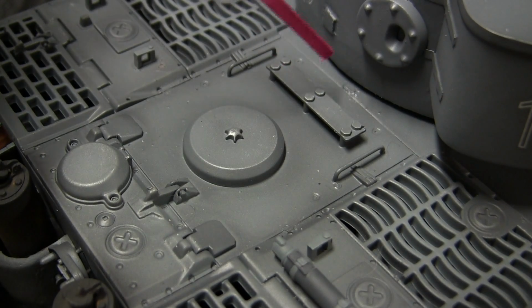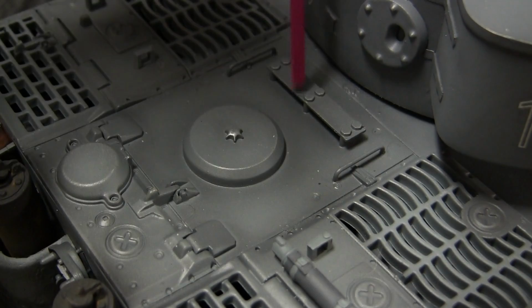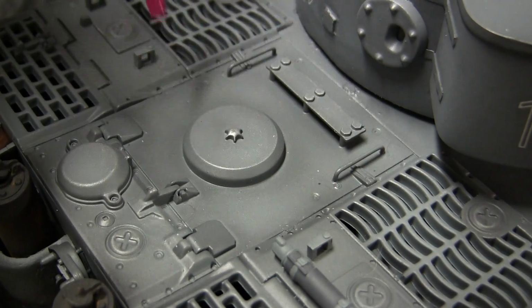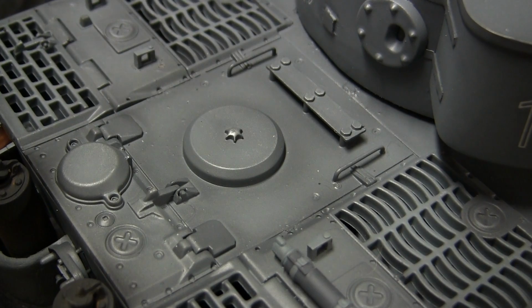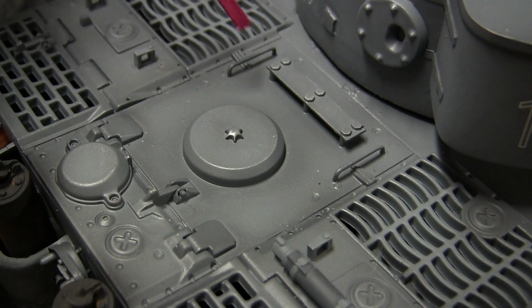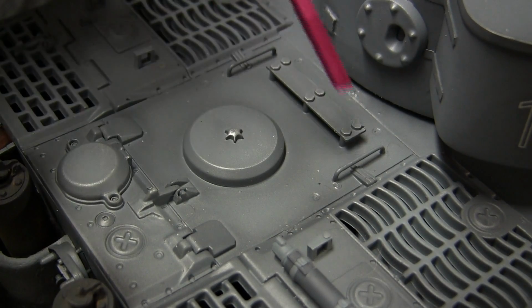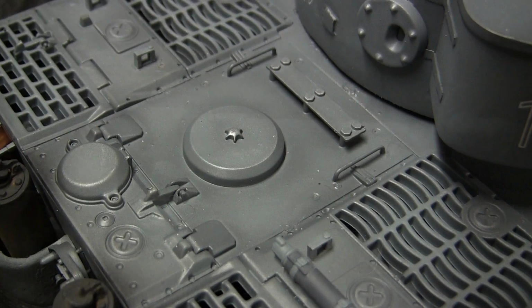I went ahead and put this piece in the mill and milled away the extra portion that overhung. The piece was then deburred and simply remounted to the engine deck. Once mounted, the backdating process was complete for this part here. Also, while we're on the back, we could see here the small little weld bead that I mentioned earlier about the top deck being two halves, as well as the handles. The kit ones were very flimsy and were replaced with new ones bent from steel wire.